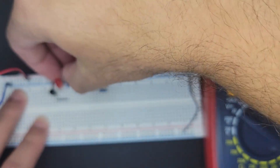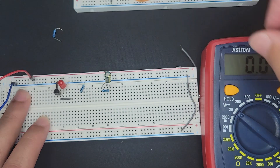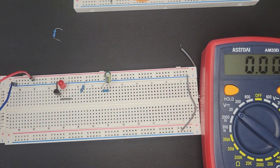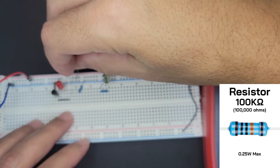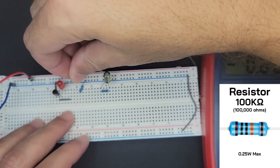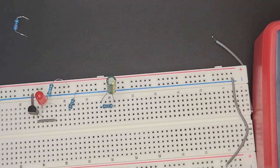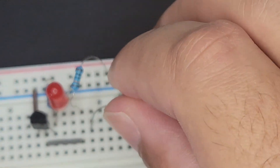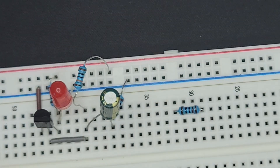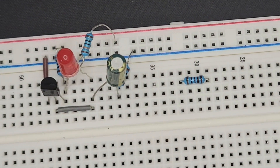I guess I need to invert the power going to the LED. I'm going to put a bigger resistor going to the capacitor — let's discharge it and see if it slows down the delay before the LED turns off. Let me swap out this guy for a bigger one. I think I have 100K around here somewhere. So here's our 100K. I'm going to put it at the base junction, which of course is coming out of this gray cable. And then we'll just put our capacitor back in, make sure power is off. So I'm going to turn it on in 3, 2, 1.